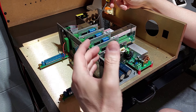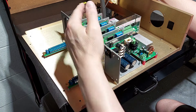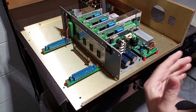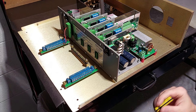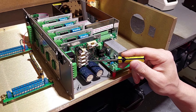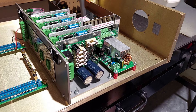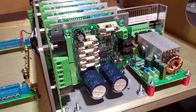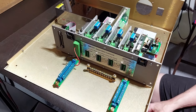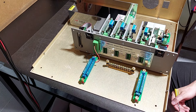This drive is its own giant heat sink — all four MST109 drives are mounted on its base, each with its own heat sink. The more metal making contact with the drives, the better the cooling gets. I put thermal paste underneath the drive and connected it to the chassis base plate, which expands the cooling even more due to greater mass. Each drive also has its own built-in fast-acting fuse along with the power supply module, so everything is simple to change if required.